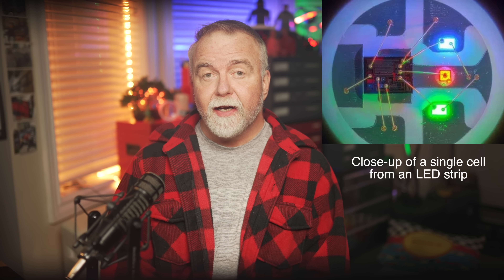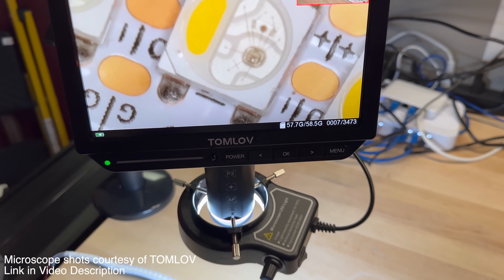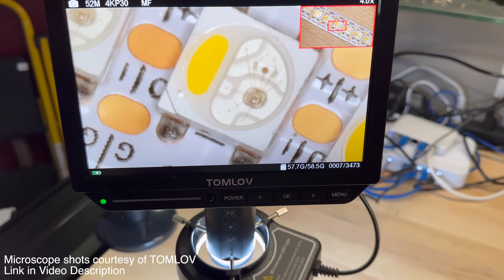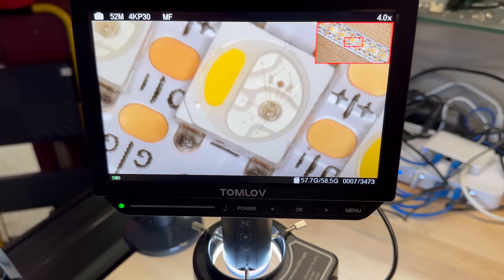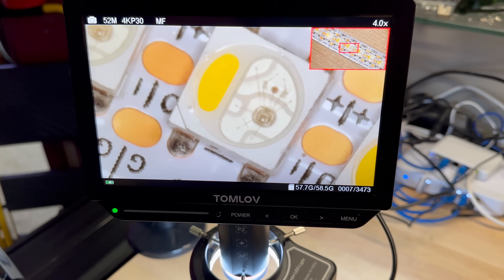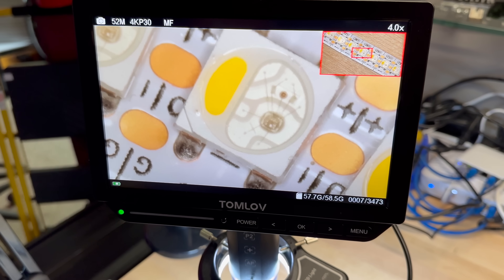Normally in a conventional LED strip, each LED location is made up of three LED elements — red, green, and blue — that you can selectively combine in various brightnesses to make whatever colour you wish, or even white. The SK6812, though, adds a fourth LED element to each location, but in pure white. While you can combine the red, green, and blue LEDs of a regular strip to make a white light, it's not very bright, not very efficient, and not the most pleasing colour of white. So having a dedicated white LED is a nice addition to any strip.